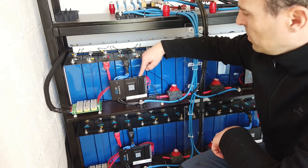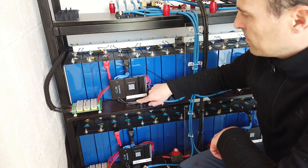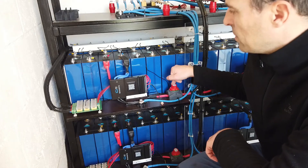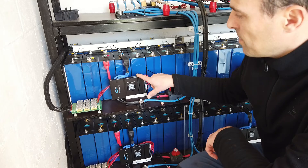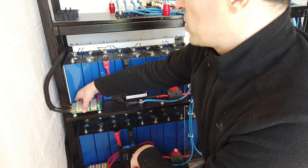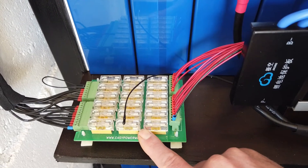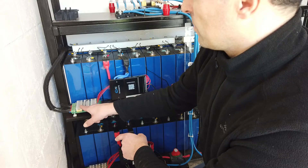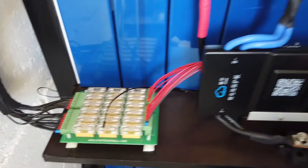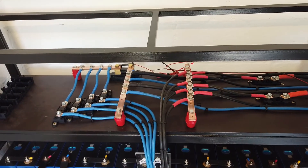This is the upper-left battery pack. The positive cable is connected to the switch; the negative cable is connected to the BMS, so even if the battery switch is off I can still access the BMS. All the BMS leads are connected to the BMS protection board, which is an extra safety feature — there is a fuse on every BMS lead. I have Phoenix connectors and these leads go to the BMS.